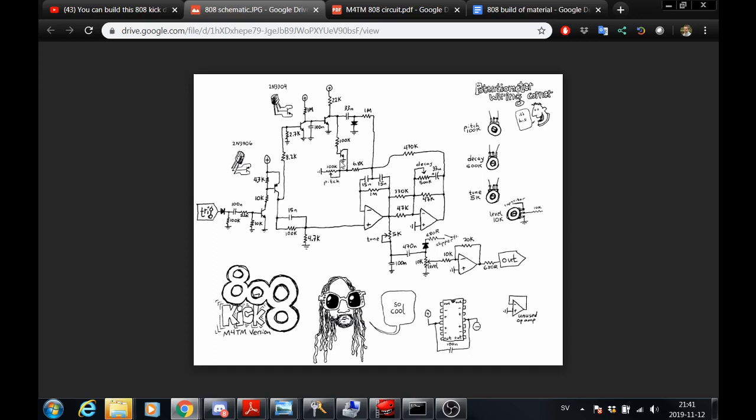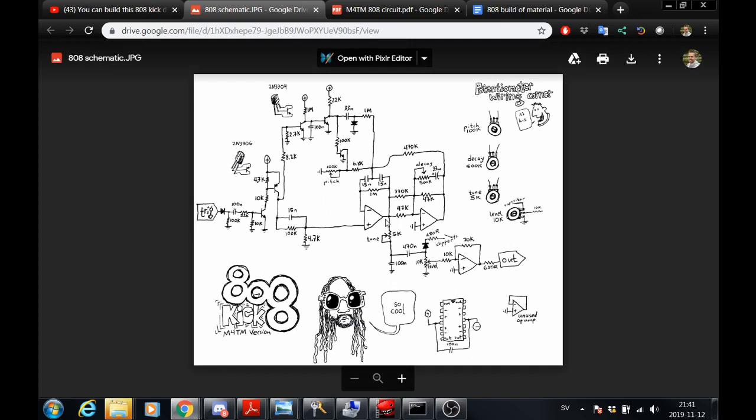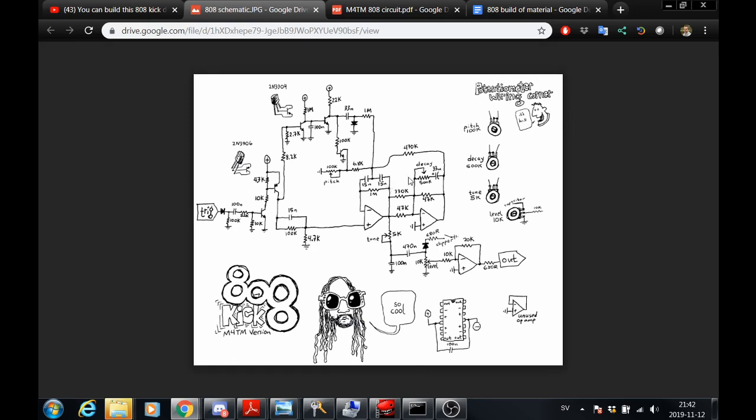And I solved that by cutting this emitter on this transistor here to ground. By removing that one, I got the pitch to work. Probably not the correct way, and I probably have an error somewhere in my circuit, but after checking it 4-5 times, I still haven't found it. And that was the only thing that did any kind of difference.